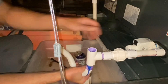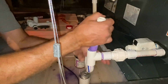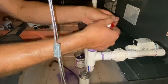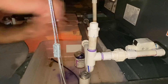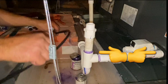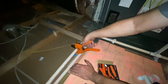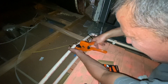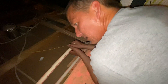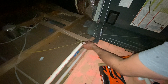I used the original piece of PVC that I had cut off with the oscillating tool and put that on the top side of that T. I did have to buy a three-quarter-inch female pipe thread PVC cap, which I threaded onto that original fitting at the top — basically just to prevent the possibility of overflow if the primary ever got clogged, even though it would probably spill out of the evaporative unit itself way before reaching that cap. Because I added that union and those threaded fittings, that PVC assembly stuck out from the evaporative unit a lot more than the original, so I ended up cutting a section of pipe to shorten it where it 90'd to go outside the house. This is where I noticed there wasn't nearly enough fall in the condensation lines running out to the side of the house — they were almost perfectly level for about five feet after that 90-degree angle.